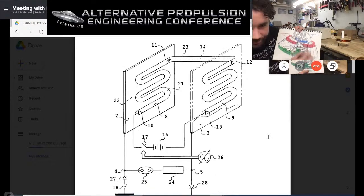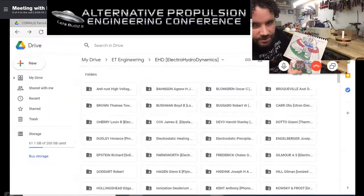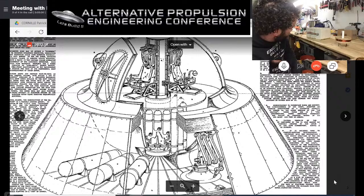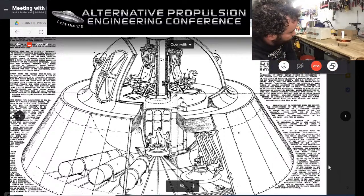Why there was a need for a glass. The coils were embedded in glass, or we could probably do the same thing with epoxy. But it is important when making these coils that they are high voltage isolated, so there is no short between the coil pieces, and neither coil that we have in stock at the lab worked. They both shorted out to their coil windings, and we're going to have to rethink this and build that coil properly with the proper bobbin. No way around. I totally agree, and that's something we can absolutely do.